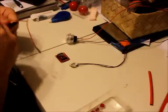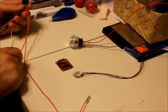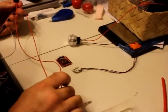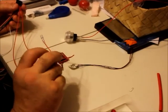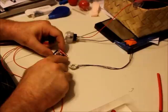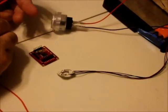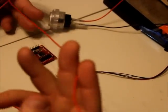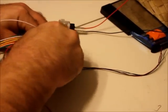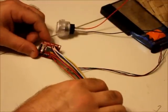If you look, one of the leads has two .110 connectors, male and female, and the other one is just a blank wire. The blank wire is going to end up going to LED power, and this is going to go to your button. If you look down at the Sparky board, it'll have punch one, punch two, punch three, punch four, kick one, and on. On the left are the button connections and on the right are the LEDs. So I take my red out here — my LED is on this side, so I want to put my harness in with the pink connection towards the top. That's the first connection to the Sparky PWM SMD.